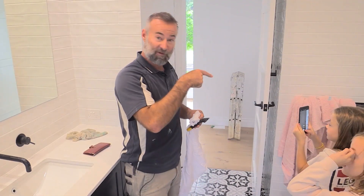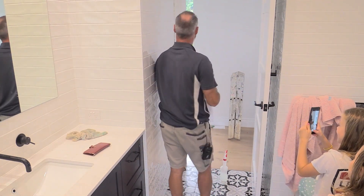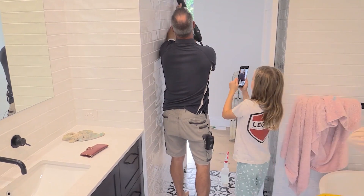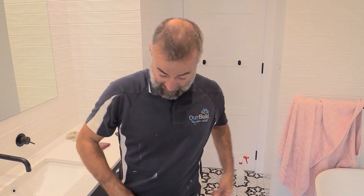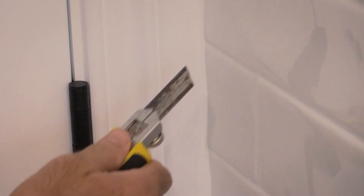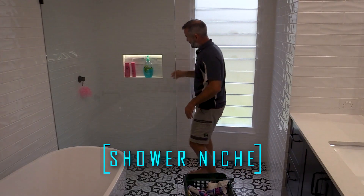I've got my Instagram filming on this side as well, with the big camera and the little camera — all ready for the action. Now a close-up of how that's come up: using the applicator and pulling it down through just leaves a nice concave shape. Spraying the soapy water stops it sticking to the tiles and to the masking tape. When you finish, give it a little touch-up with your finger to smooth off any bumps or lumps. Generally that's it — all finished.